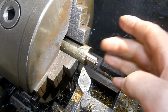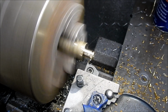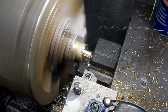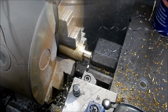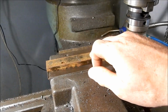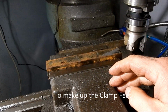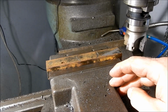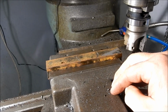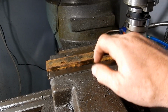We'll deburr that and set that up for cleaning. Done. Alright guys, got this bit of black stock. It's 25mm square. We're going to knock that down to 20mm. I'm going to cut it off to lengths, machine it to length, and then I've got some 45 degree cuts to make into that, just to help support any round stock we might be using with these Kant Twist clamps.